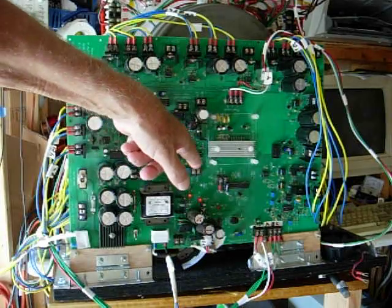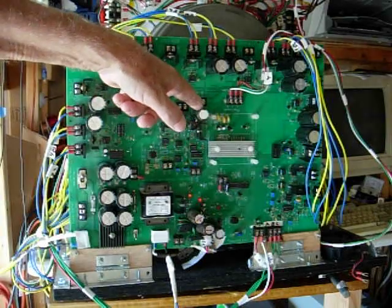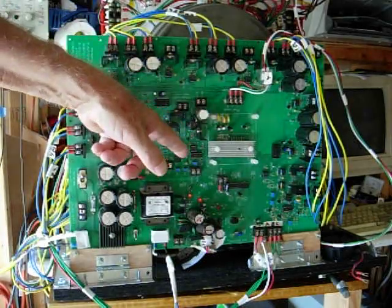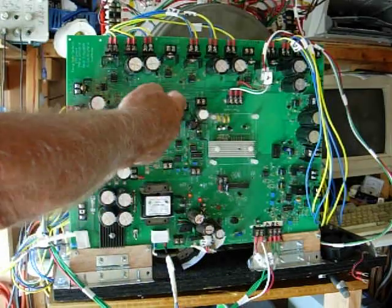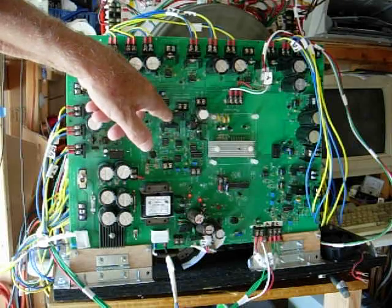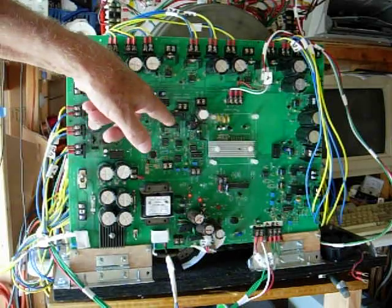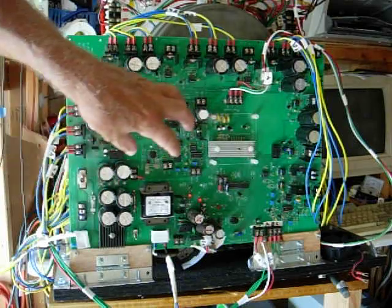And eventually this circuit here is used to convert DC voltage to another DC voltage, so I can adjust it for 12.85, 13, whatever, to recharge the batteries or the capacitor bank. This circuitry in here is used to control the primary ground, 2 ends of the primaries on a transformer with the center tap has a positive DC going to it that provides a ground path for that, and that's isolated.